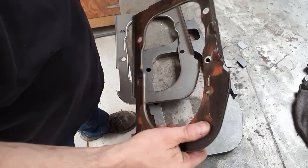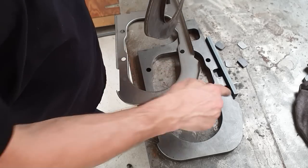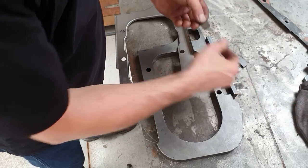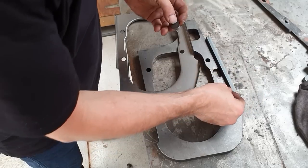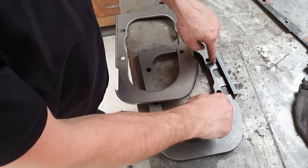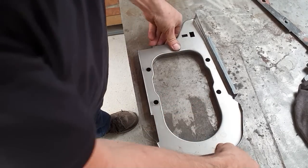To make these dimples, they've only actually got to go down by 4mm between the bottom here and the bottom of the part. So these plates being 10mm thick, I've just put some small packers here. These are 1mm, so 1mm goes in that one and that one. And then we've got some, I think these must be 5mm. So that goes in there, that goes in there. So now that will bottom out 4mm down. So we're going to put this piece on top. Now located.